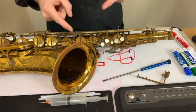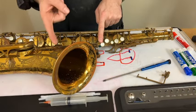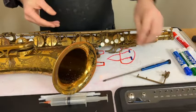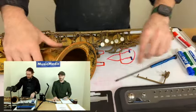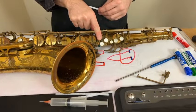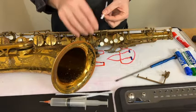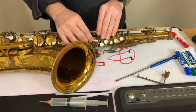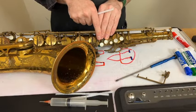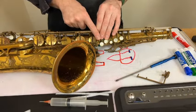If you sign up for the key fitting course, I'll show you diagnosing tips and tricks on deciding which side to first counterbore, and what side to ream as well. What about those pipe cleaners? Since I'm cutting the inside of this post we could have some brass chips and dust. After a little bit of counterboring, before I assemble — even before I put the pivot screw in — I will take a pipe cleaner and just work it in to make sure there are no brass shavings, because that could cause the screw to bind and damage your internal threads.